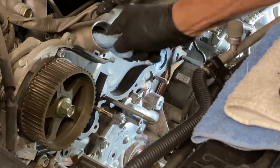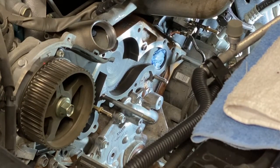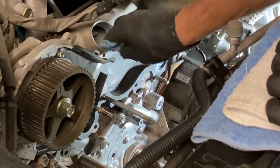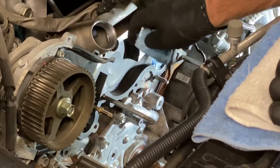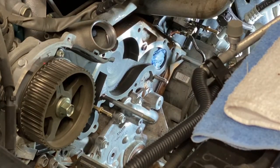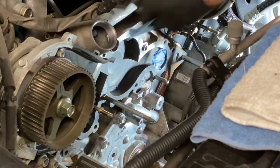I noticed some guys on the East Coast, when they assemble this one, they put grease on the O-ring. They have a lot of problems with corrosion, freezing things in — seems to work okay. Others I've seen put FIPG, form-in-place gasket, in these. That is totally wrong — you do not want to do that. I just assemble them with a little bit of dish soap, Dove. Dish soap is a real good one. That's what the book calls for — I just go by the book on that.